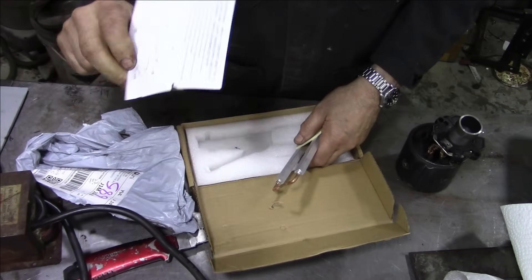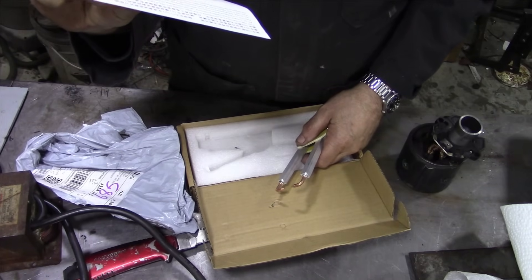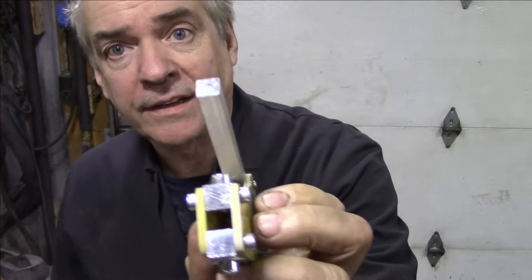The instructions are going to take some working out. I'll read them out - I thought it was just in Chinese. 'Part 10b in the figure connects to the main output line of the spot welding machine, generally 4 volts to 12 volts.' Part 10b is the pressure adjusting screw for the welding pen - there it is, under there. 'The electrode chuck - during welding, two electrodes clamp the object to be welded and carry out resistance welding.' Is it going to work? I don't know.